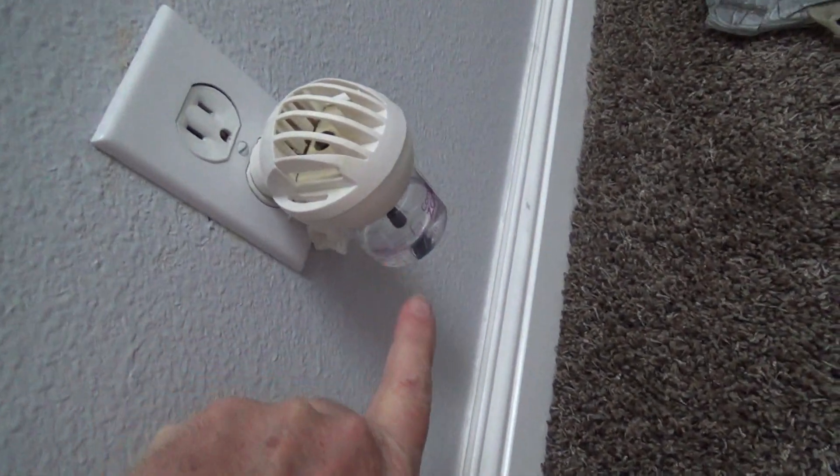This is a 15 amp, and there are three different ways to install a wire on a 15 amp electrical outlet. Here's one way — on the back, see those little holes? You would poke the wire into the back. Another way is to loosen up this side screw and put it on the side like that, then clamp the screw down. I've seen electricians do that. I don't like doing it that way because it has a tendency to possibly slide out.